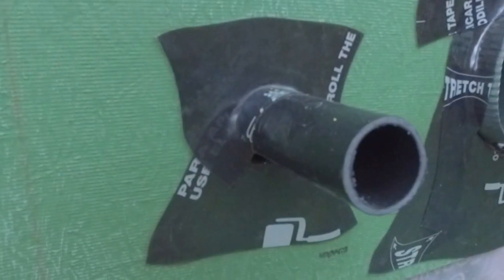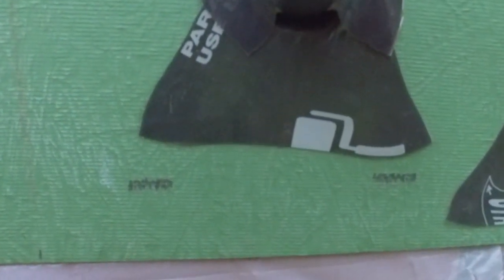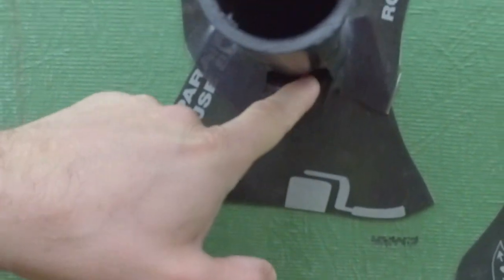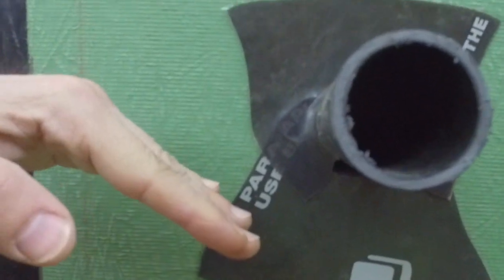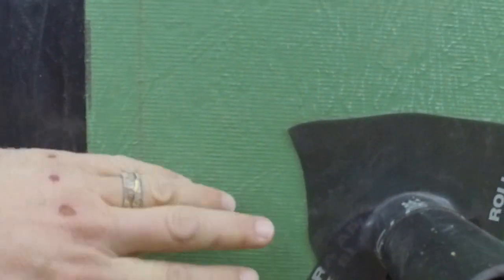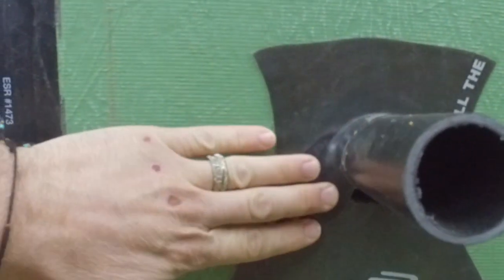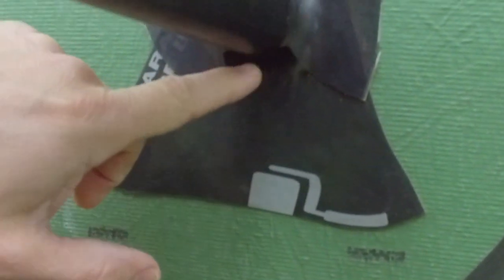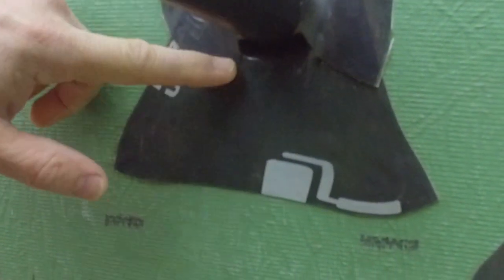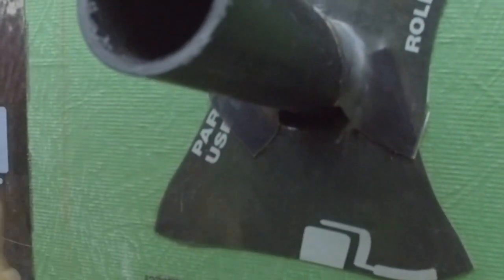Michael explains the flashing process on a couple of wall penetrations. We've got one layer of zip tape that goes inside the opening and is seated all the way underneath. And then the second layer of zip tape that goes over the top like a hood, kind of like a shroud. So it's nicely protected. This opening is really well flashed. It's foam back there, so it's air sealed. And in case water comes and wraps around here, we know it's not going to get into the OSB — it'll roll down the face.